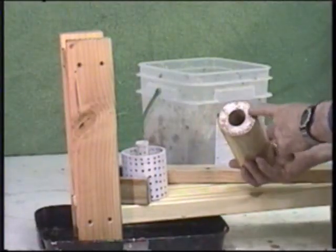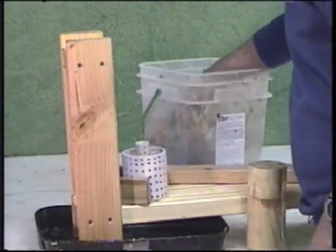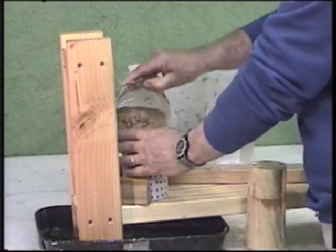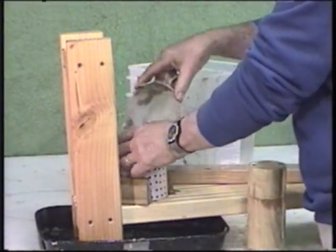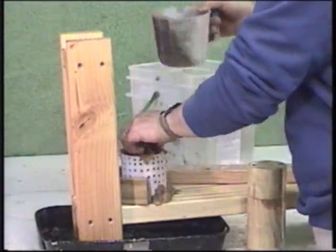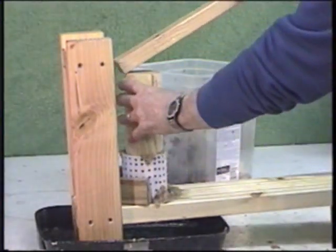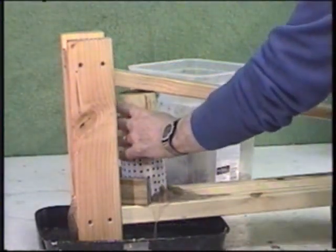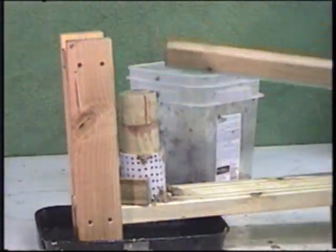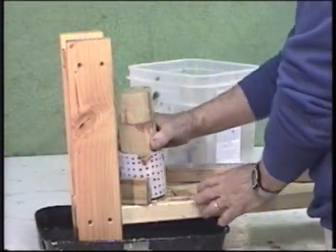We have the plunger that has a hole in the center to accept the drainage tube. With that, we'll make a briquette. We're using some of the same mixture we had before. Sawdust with paper pulp, 80% sawdust, 20% paper pulp. Fill up the briquette mold. We use a short dimension as we did before. Do an initial press and turn it around, and we'll lean on it a little bit like that. And this will generate about 200 PSI on the briquette.